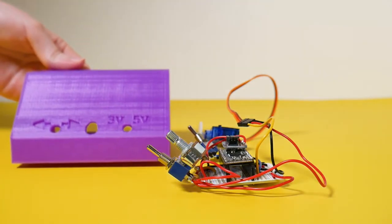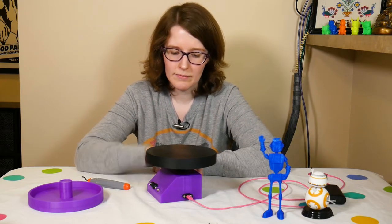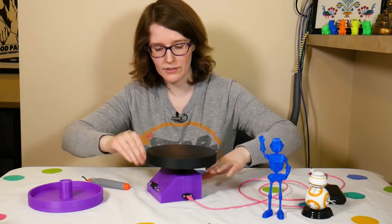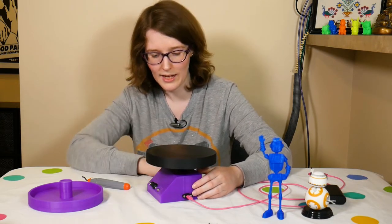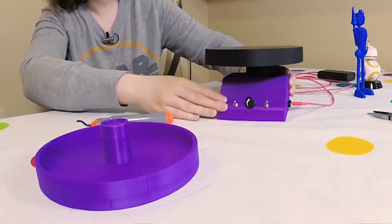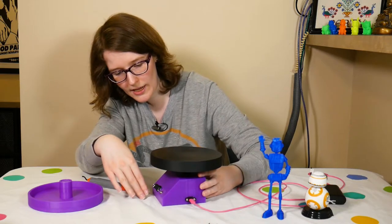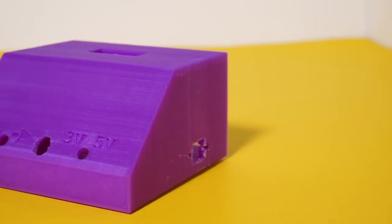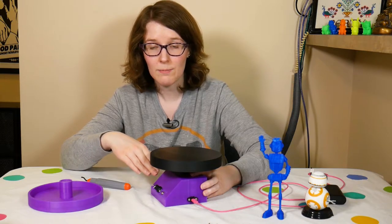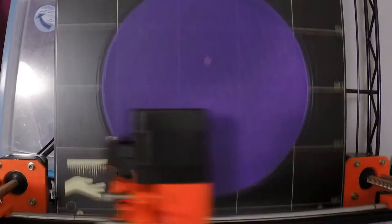This is a 3D printed enclosure - it is a snap fit box. Shout out to the Ruiz brothers; that tutorial on how to do snap fit enclosures is just top notch. I'll throw that down in the description as well - you can't go wrong following it, it's literally foolproof. I did a chamfer to get this diagonally flat edge and then extruded it in by about two millimeters. I have arrows here to show directions and used the text effect to put the 3V and 5V symbols on the side. Holes are cut out for the switches and potentiometer, and everything about the design in Fusion 360 is parametric, so you can edit everything. I'm going to be releasing the Fusion 360 file on Thingiverse and in the tutorial I eventually write for this project.